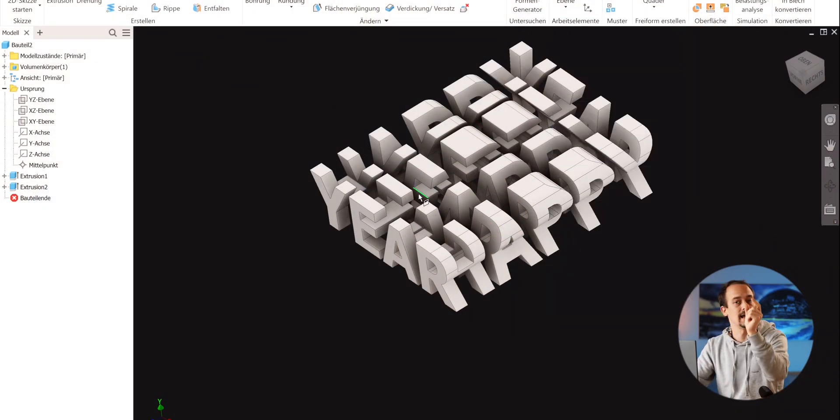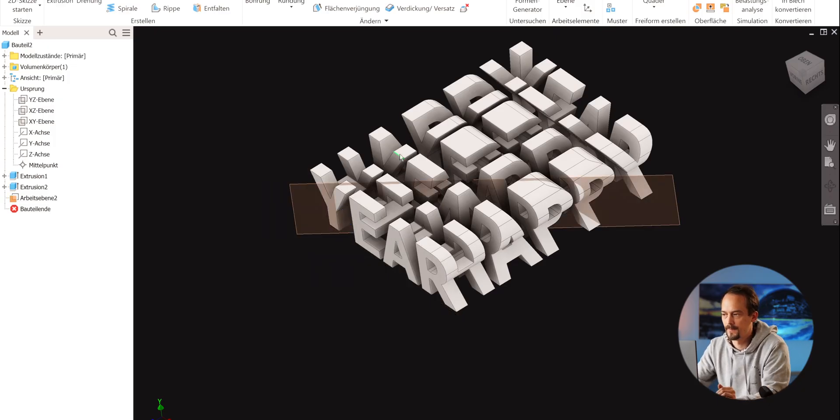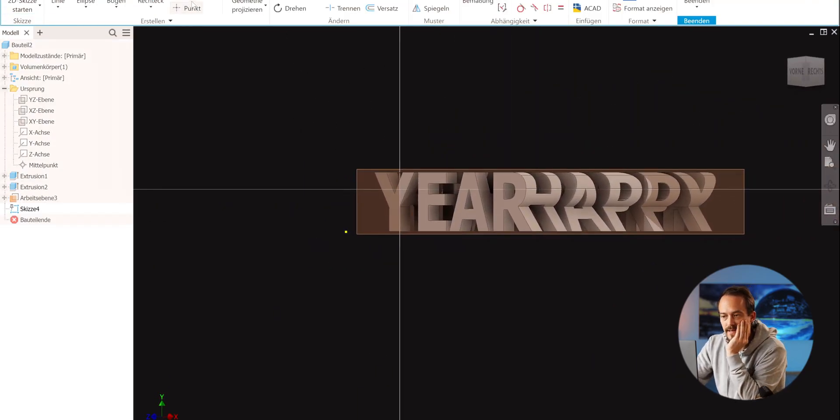In order to add the third perspective, I need a 45-degree angle from the original. I simply choose a plane, look for an edge of the part that is straight up — for example the Y is very good here — then I click a second time and say I want 45 degrees. I'm pulling the plane out of my part, then accept that and do a drawing on it. In here I simply write 'New', again in capital letters, 10 millimeters big.